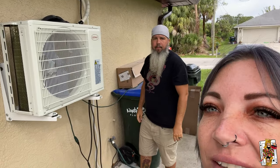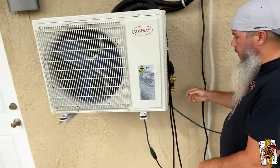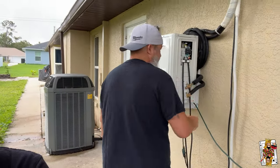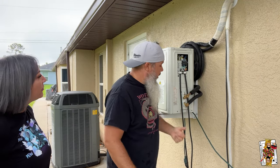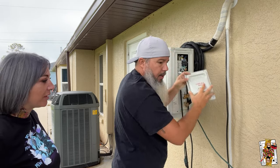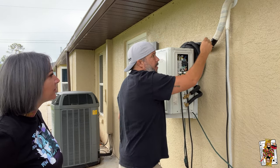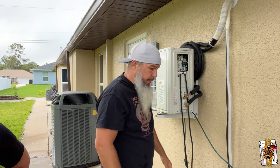It's up! I got it hung - it looks good. An AC neighbor just came out and we hooked a vacuum up to this. These are all tight and have a good vacuum. Now we've got cover panels - going to wrap the rest of this, pull it down, zip tie it out of the way, and make it look good. We technically have AC in the garage! Now we're getting cold. I guess go to the store and get a parka?